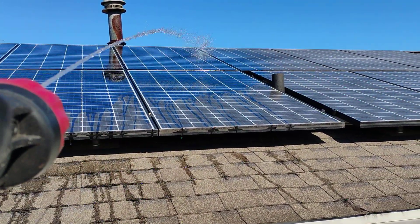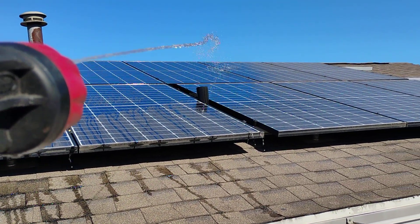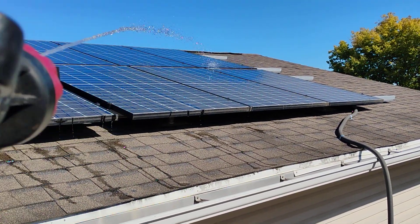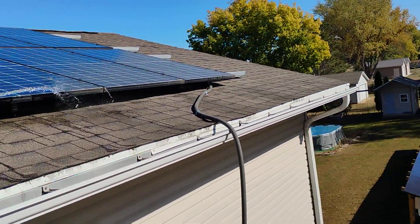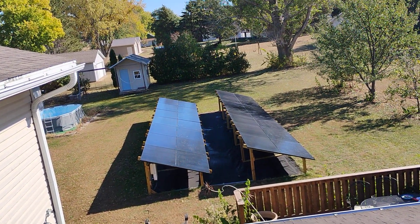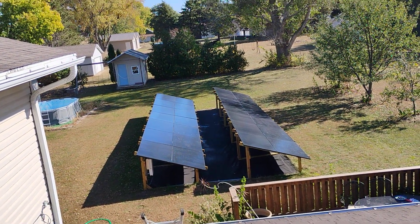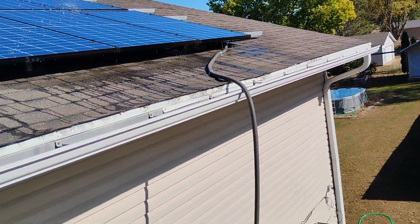Should be producing nearly twice as much power now. These up here are 6,000 watts — 20 panels with the IQ7 Plus microinverters. Those back there have a single inverter; they're supposed to be doing 10,000 watts, but with a little bit of shade from the apple trees, it only does about half that.